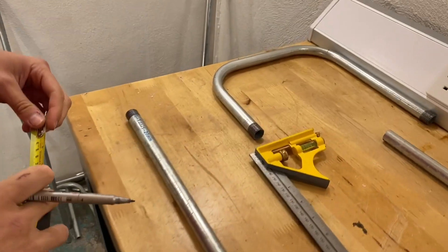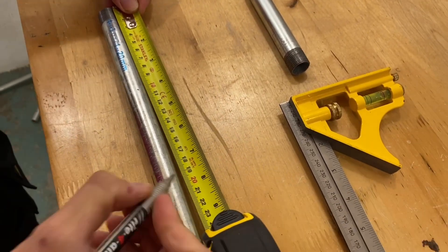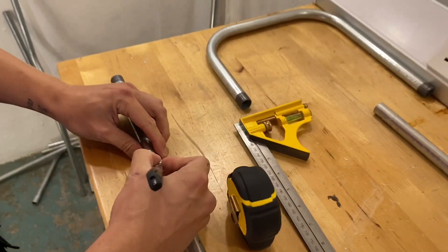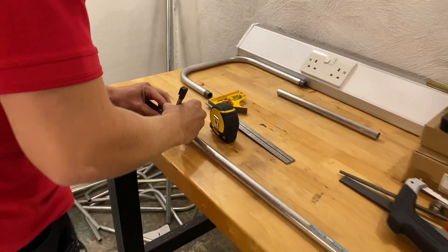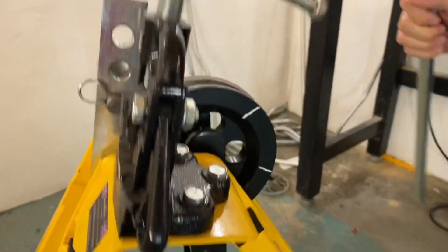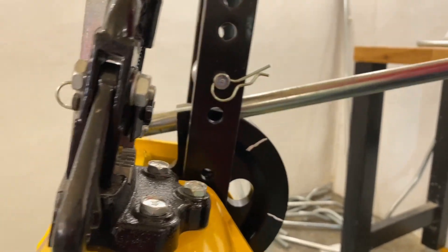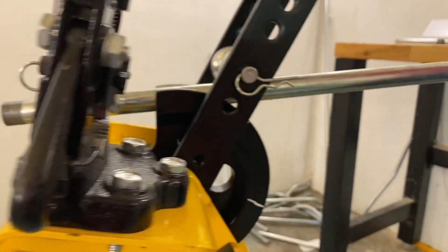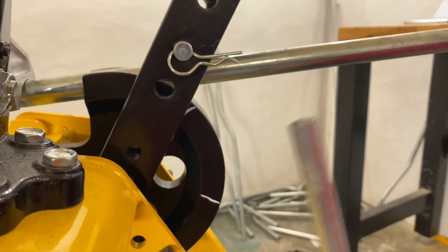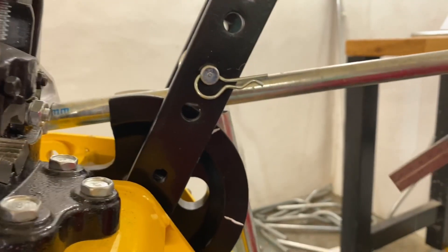So as you asked Gary, the first bend is going to be 200mm to the back of the bend, so I'm going to measure from the end of this piece of conduit here to 200mm. Take it over to the conduit bending machine — and this is where we use that scrap piece of conduit in the set square, as we've seen in a previous video. Nice bits of Tippex on there again — that video is worth checking out — so you're in through to the stop.